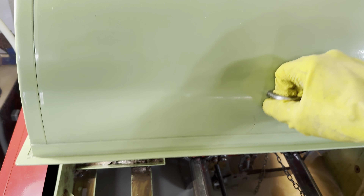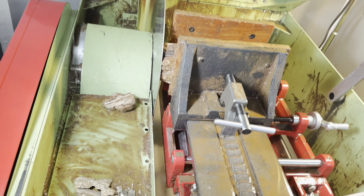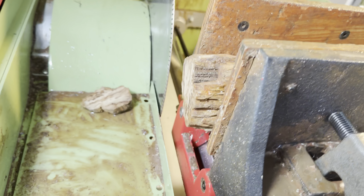The first step is to get the piece loaded in the vise, get it in there nice and tightly so it doesn't move. Then we move the carriage over just enough so we can cut off this little end section and get a nice flat bottom to use as the base. This looks pretty good. Let's give it a whirl.